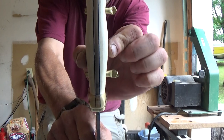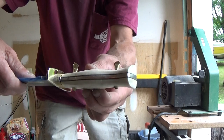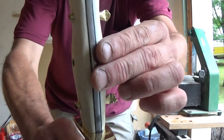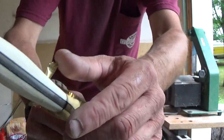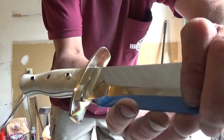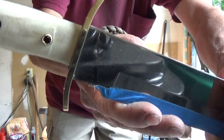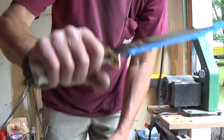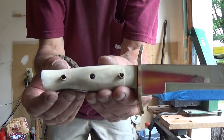I put the black liners in there, as you can see. These pins here are just stuck in there just to hold it in place. It's got a really super nice shape to it. Just got done this morning taking the brass guard down to 600 grit sandpaper and then polished it with the green jeweler's rouge. I'm really super happy about the way this is coming out. It's going to be a real beauty once those mosaic pins are in there.